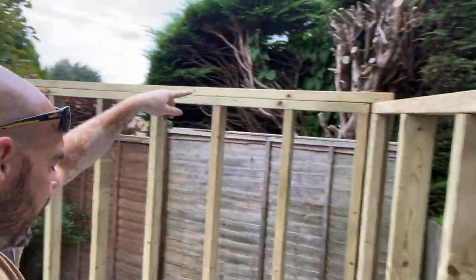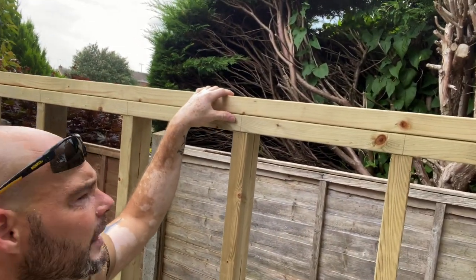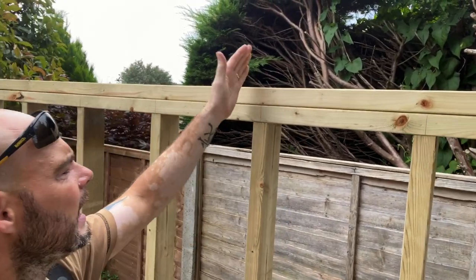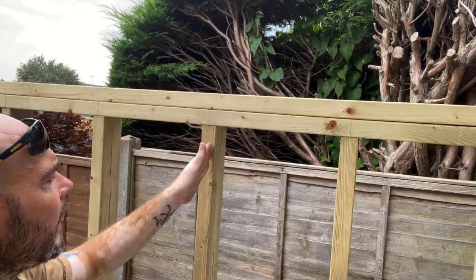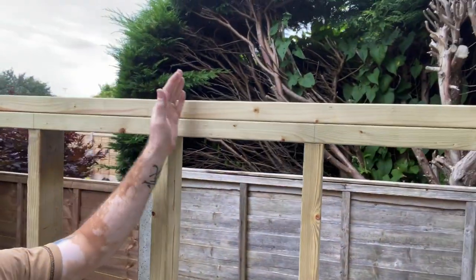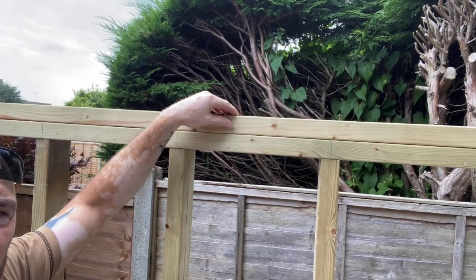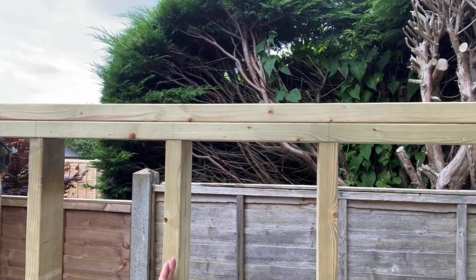The other thing is, it gives it extra strength. So when you're building structural bits and pieces from wood, say for argument's sake this is the back wall, if you know that your roof joists are going to fall directly over your studs, you don't necessarily need the trimmer, right? But if you think that your roof joists could be coming sort of here, you need the second layer, because it will then distribute the weight evenly through here, okay?